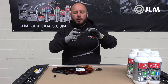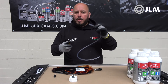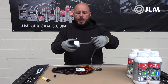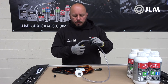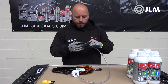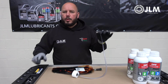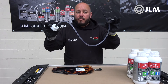Depending on the temperature in your workshop, it may be necessary to warm up the pipe end slightly with a lighter, and then as you can see it pushes on very easily. We'll do the same with the other end — just a quick warm up. Once it's on and you give it a few seconds to cool down, it has a really good hold and you're not going to get any leaks.